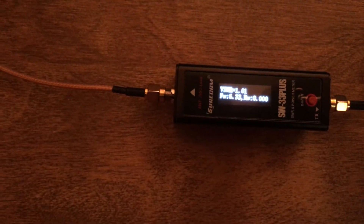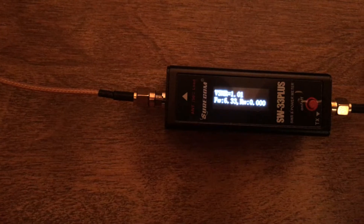So you can see that's about 6.35 watts — just a little over six watts — and the SWR is 1.01. It's a stock repeater with the stock power supply that came with it. The handheld in the other room is what's recording my voice and playing it back through the repeater. Let's hit the road.